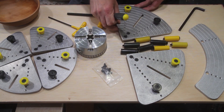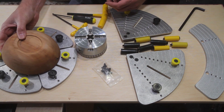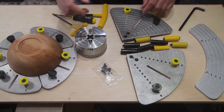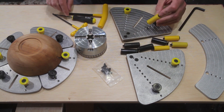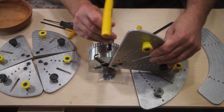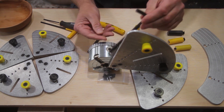If you are working with a smaller bowl with a curved side, edge, or lip, the standard grippers will work. If you are working with larger projects or something with a flat side or edge, the optional 2 inch EasyGrippers will work great. To lock down your jaws, you will need to use the supplied Allen key instead of the T-handle hex chuck key.